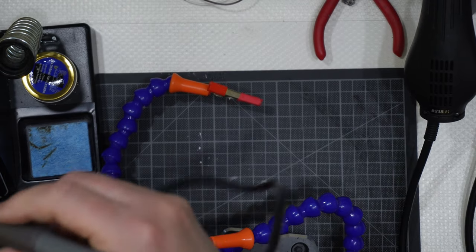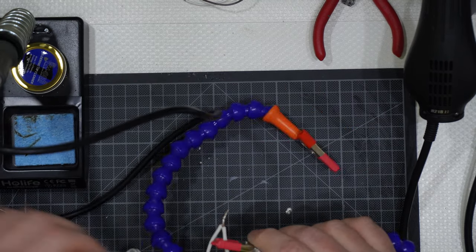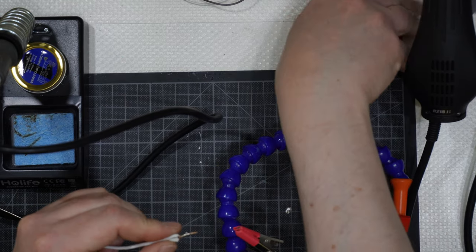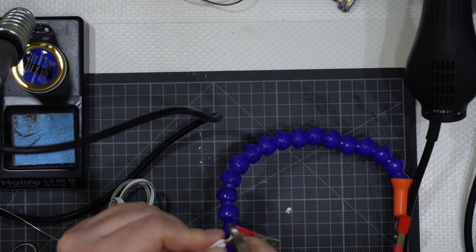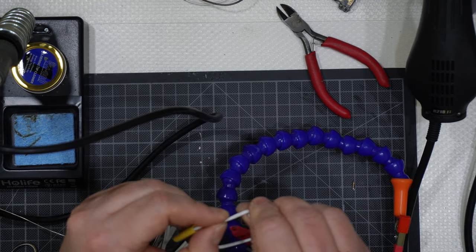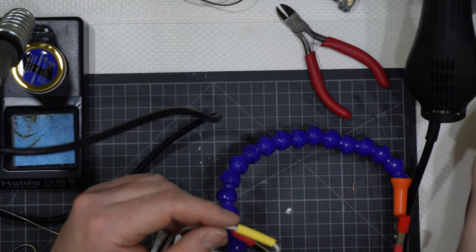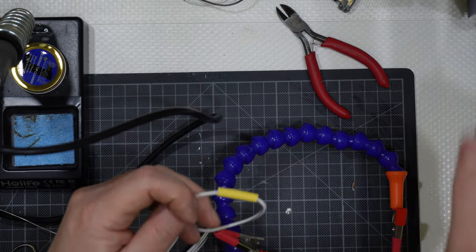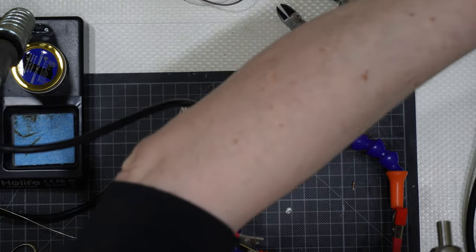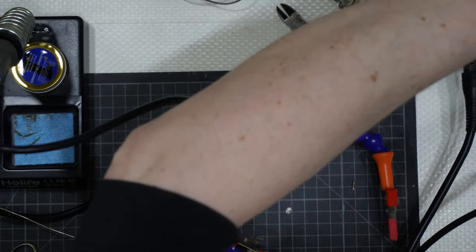I can clean the tip once more, okay, and it is soldered together, okay. Then I will take the cutter there and I will remove some parts. This time you have the tip the other way, and then the heat shrinking tube. Let me use this one this time, and you can hear that it has started getting up, and here you get the temp that is going up. It has reached 302 degrees.